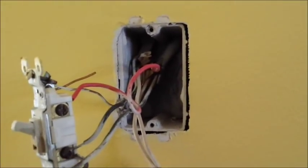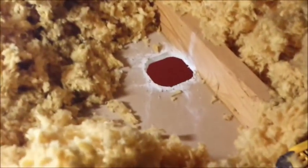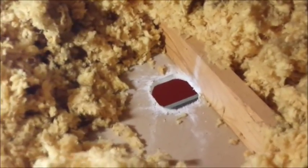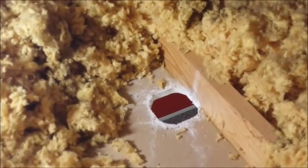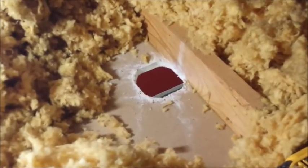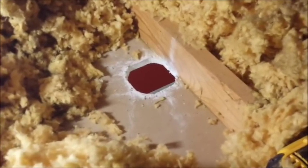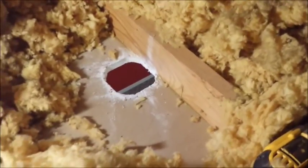Let's get up in the attic and get this process going. We're up in the attic now — lots of insulation that we pushed aside here right by the hole where we're going to put our box. Just remember when you come up in an attic like this, be careful while you're walking because you don't want to step right through the ceiling. Always wear a mask to filter out the fiberglass or any kind of other airborne particulate matter that will get in your lungs. Use your safety cautions — this video is not intended to give you all the safety cautions needed when working in an attic.